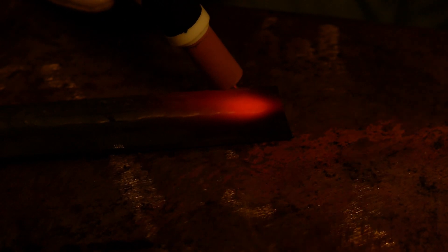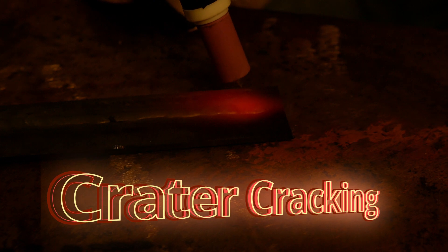Don't be intimidated if something happens — simply stop, fix your filler material or your tungsten, and tie back into the weld again. When you get to the end of your weld, add a couple extra drops of filler material as you slowly extinguish your arc. This will help fill in and eliminate any crater that would form. Crater cracking is common, so this is a good technique.